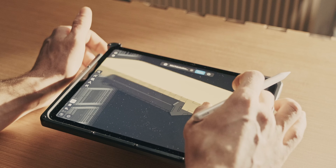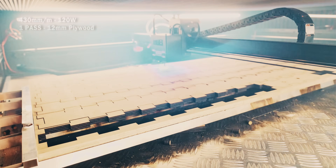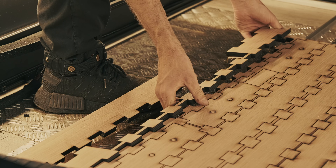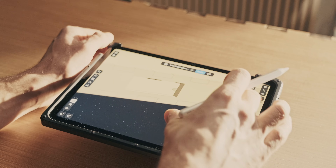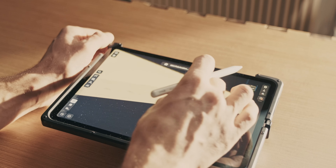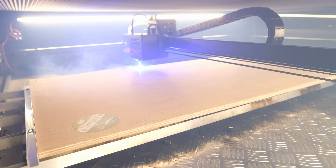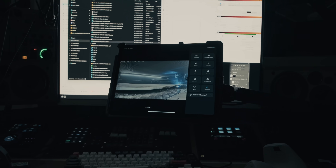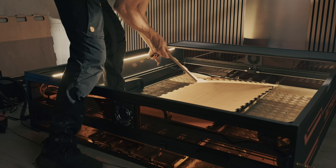I'm not too sure I made the right choices with this one because it's really thin. I dropped the laser speed down to 430 millimeters per minute at 100% power, single pass, and it came off really quite cleanly. I've already made the holes to connect the entire setup together, with a main gap that allows cables to run through the body. Something I always do with laser cutters — since they're quite dangerous for your eyes — is sit in a different room and use a little security camera inside the machine. If something really bad happens and Lightburn doesn't work anymore, I can also switch off the power.